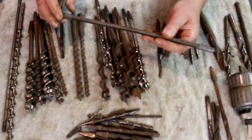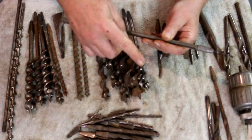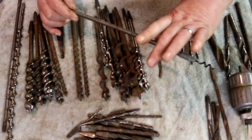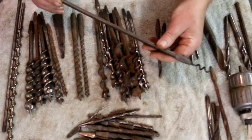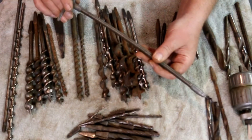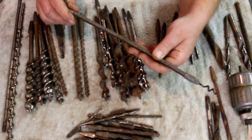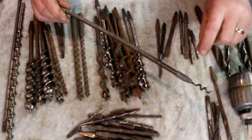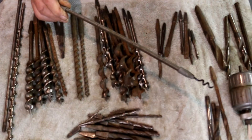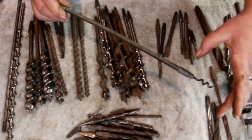After you pull the packing gland — which was always a pain in the neck because they were usually made out of brass, or had a brass lining in them — and they had a series of bolts around it so that it would draw the brass, which was the guide for the rod. You'd pull that out, take out all the bolts, get it loose. Then you would slide this around and slip it down into the hole and turn it, and that corkscrew at the end would go in and hook into the Chevron packing, which was wax impregnated and formed into the shape of a V. The V would go into the cylinder with the V open, so that when the pressure hit against the packing from the oil inside the cylinder, it caused that V packing to open up and tighten onto the shaft and stop any leaks.